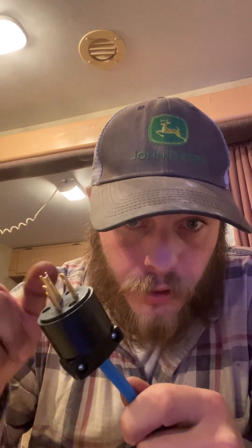Go get some of these connectors from Amazon, Home Depot, Menards, wherever. Wire it up exactly how this plug is meant to be wired — black, white, green — just like you would in your house. That way, when you've got 200 feet of cable running, there's no guessing which wire goes where. It's black all the way through, green all the way through, white all the way through. Keep it simple: white, black, green.